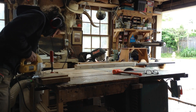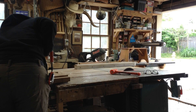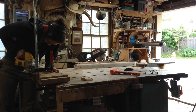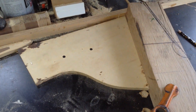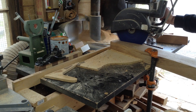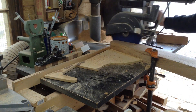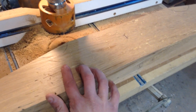This lumber is almost two inches thick, so cutting through it with a jigsaw is a pain even with a decent one. The edges are curved up to the top, and I am doing that part with the jigsaw, then cleaning it up with a belt sander. For the bottoms, they're going to be angled and also have a half circle cut out of them. I'm cutting the angles on the radial arm saw — you can raise the blade and make sure it tracks at the exact angle you want, with a piece of wood screwed to the tabletop as a fence. These bottom braces are a little over two inches thick, so I went through in a series of cuts rather than all at once, as the radial arm saw would probably bog down and catch.